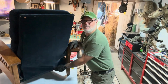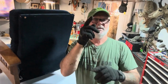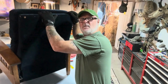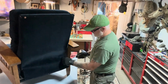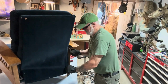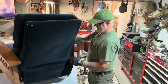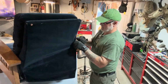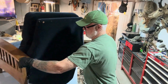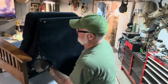So you relieve the bottom of the chair of its staples. On the side here are those metal barbed tack strips that you punch in, and on the top is always going to be cardboard. So you just slowly, systematically use your staple puller to pull it out. You just kind of pop them loose. A lot of times they'll just pull out like that.